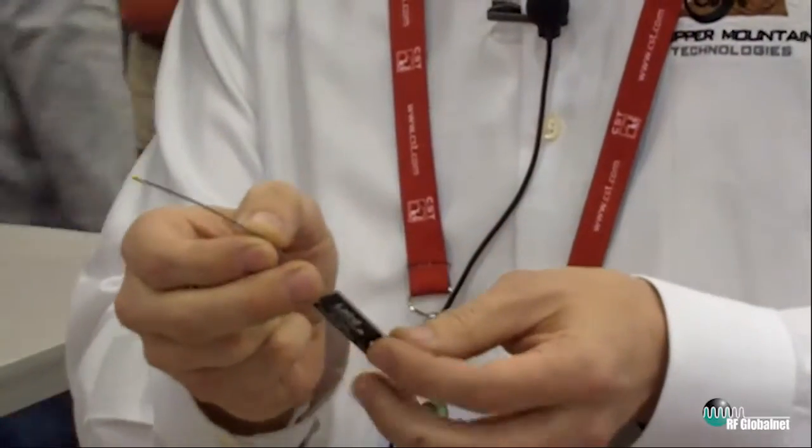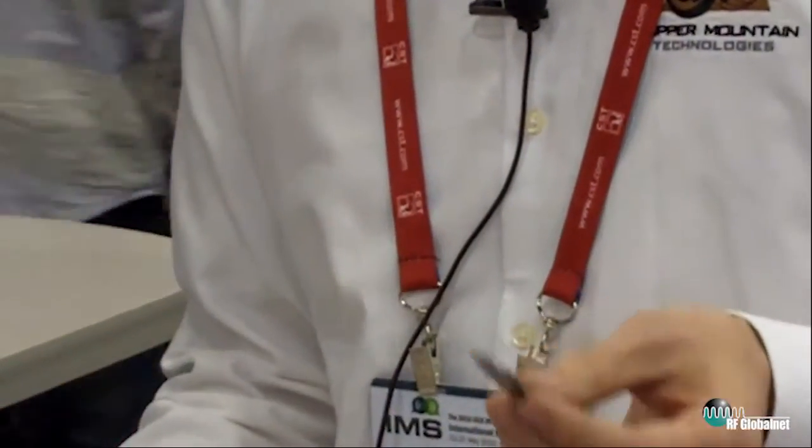It's one thing to look at the data sheet of an antenna or to use a reference design, but when you put that antenna into a housing, its match will change. The housing of the product does what we call detuning. So even if the antenna is well matched to the module outside of the housing, once it's inside you need to repeat your tests and confirm the performance is up to par.